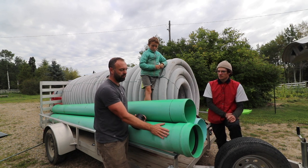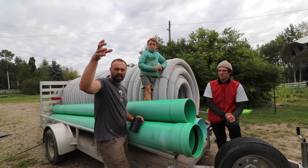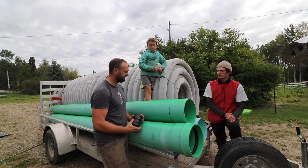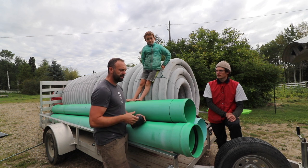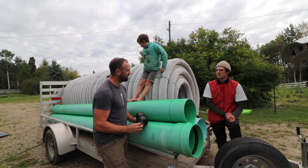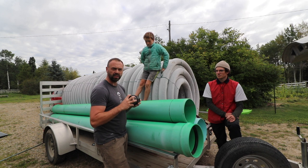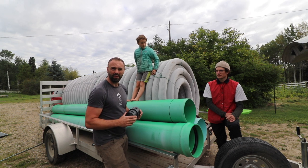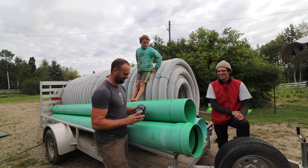The third pipe is going to act as our intake. We have to bring the intake up on the back wall, and it's going to go higher than the outlet on the other side because it wants to pull from the hottest air. We'll go through those details as we build it. We're going to lay the pipes out with pens and then I've got a big drill to core these out. Hopefully Mitch's biceps are feeling strong today because a 4-inch hole saw puts a lot of torque on your body — you've got to be really careful. Hopefully you had your Wheaties this morning.